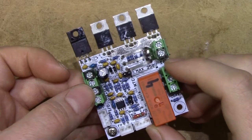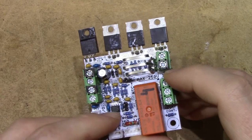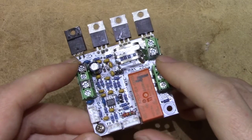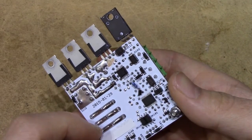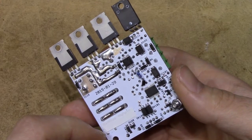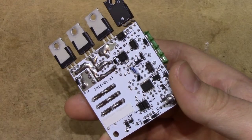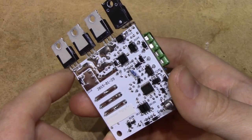In order to assist the unit in data logging in case of a communications failure with the computer, we also added a 512KB EEPROM, so this thing can do internal data logging as well. It has a pretty standard 8MHz crystal, so the timekeeping isn't going to be too fancy, but it's going to do. It's a good backup just in case the PC interface fails — you won't lose your data. You'll be able to read the data later on, and it also enables the units to run standalone if need be.